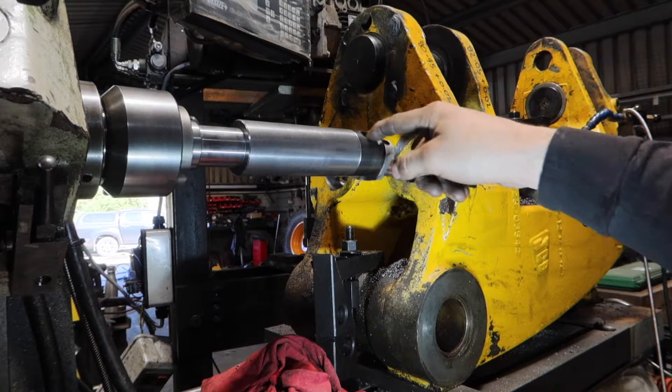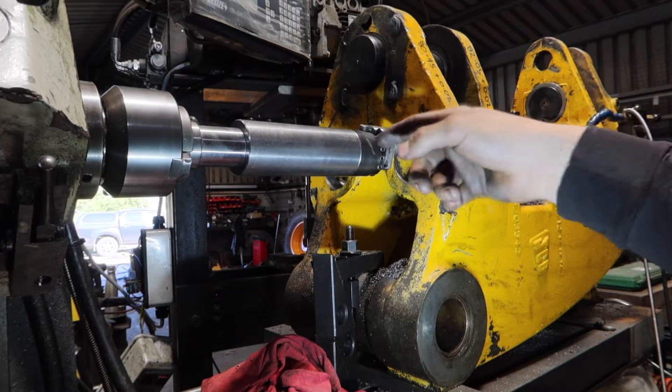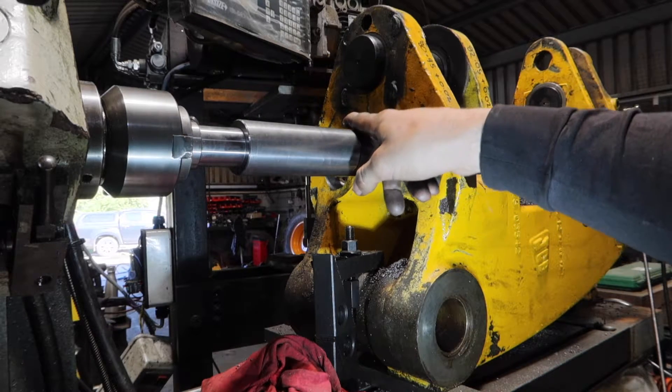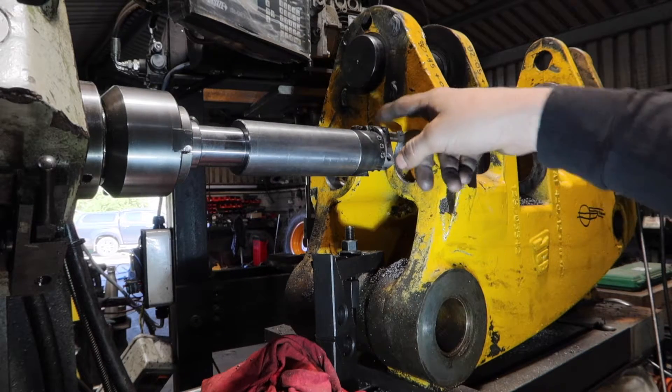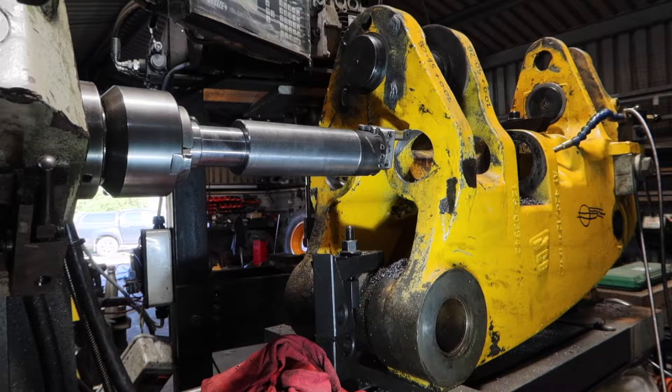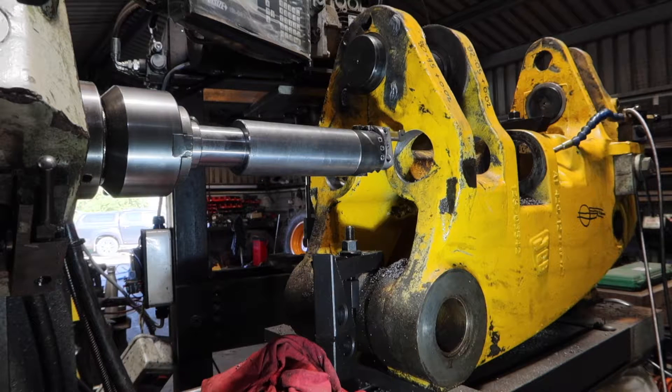You can take the boring head off — it unscrews off of there — and pop the coax in there. I'll put a shot of centering it in there, but I was just waiting for everybody to be out of the workshop so I could put some torque on here. We're going to bore these out to 65mm. The pin size is 55mm, so we'll bore these out to 65mm and make some sleeves up on the lathe and see if we can work out a way to press them in.